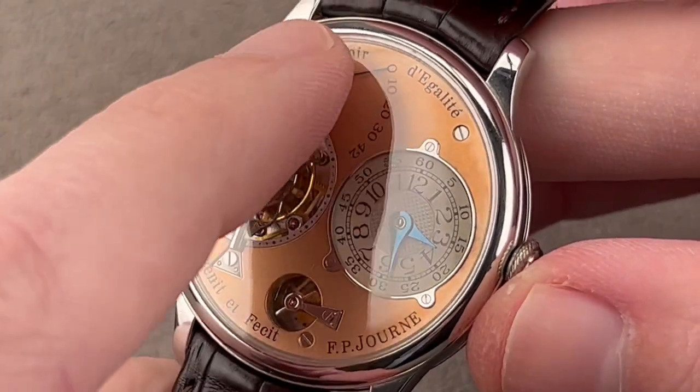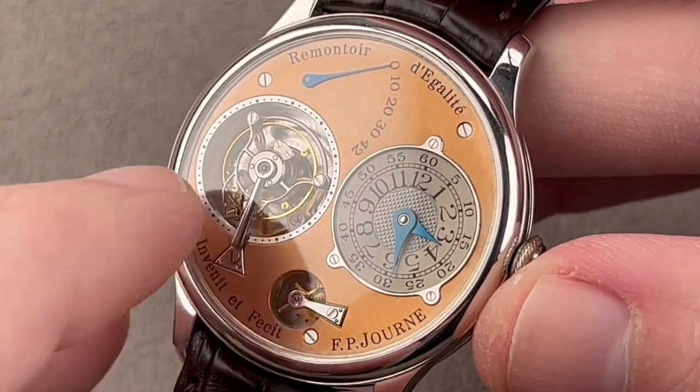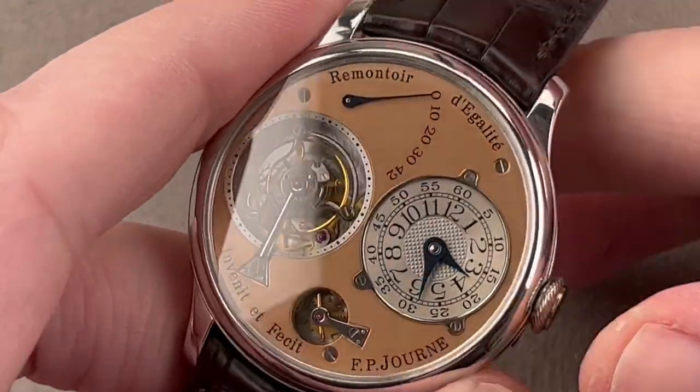Being all platinum with a gold dial, it does feel hefty for a 38. It has the black-polished and flattened Remontoire Cock characteristic of the third and fourth series tourbillon remontoire. It is a gorgeous watch — for 28 of its 42 hours, it maintains constant amplitude via that remontoire constant force device.